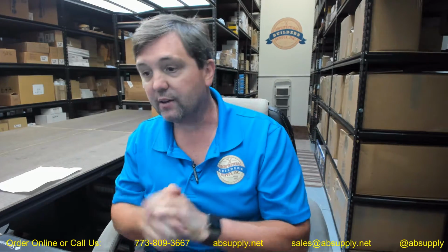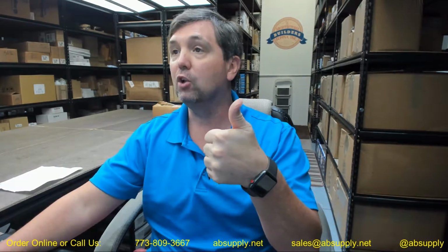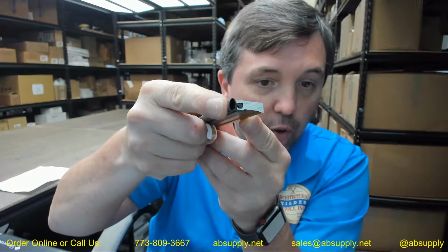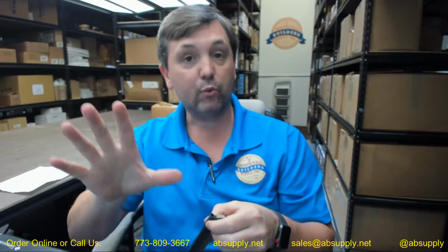Now, having said that, the dimensional properties of this item, it is available in, let's talk about the finishes, then the dimensional properties, I guess. Mill aluminum finish, dark bronze anodized finish, obviously the gold finish. The insert is the S, and that's going to stand for silicone. A very good, an exceptionally good quality insert material. That silicone is really known for its ability to tolerate extreme temperatures and remain flexible.